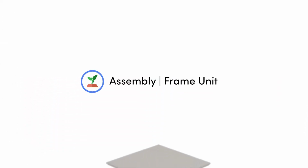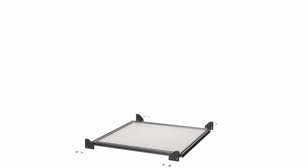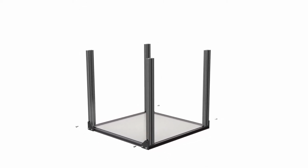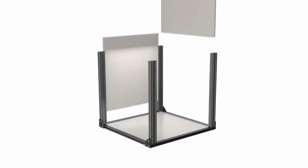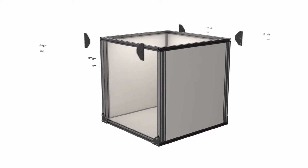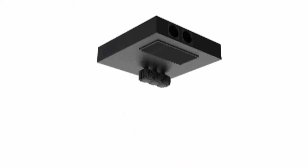The growth environment features a frame and panel construction. Aluminum extrusion with engineering plastic brackets provide a lightweight and sturdy frame that includes channels for easy component mounting and repositioning. Mylar laminated foam panels provide a high degree of thermal insulation and reflect light internally, making PeaPod more efficient.